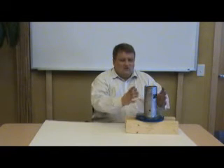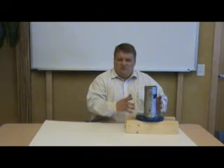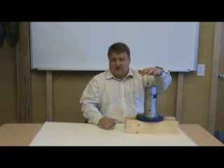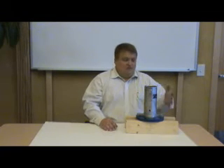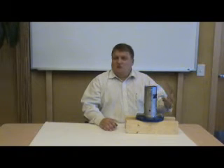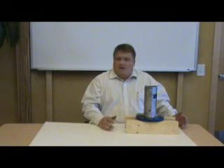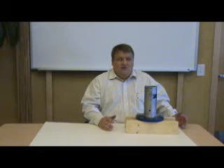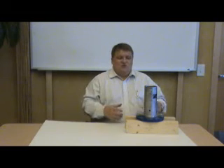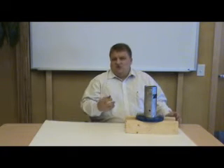Once you're all ready to go, it's assembled and your machine is ready for action. You will know that the pressure relief valve relieves pressure by putting your hand over top of here, and you will see that hot air is escaping. Besides the set pressure and the smooth action, we help solve one last problem, and that is the diagnosis of system issues. If you go with regular weight-loaded valves, you might hear hissing, but you really do not know the quantity of air escaping, because the air usually blows off the circumference of the valve. So here we try to funnel it through the shroud, and it comes out in a concentrated flow.